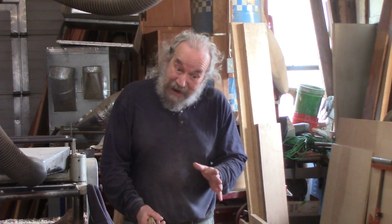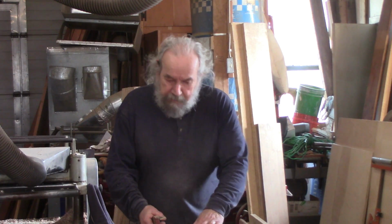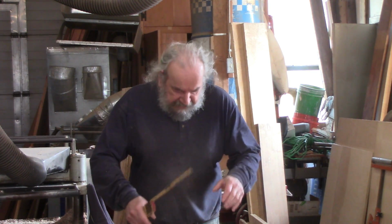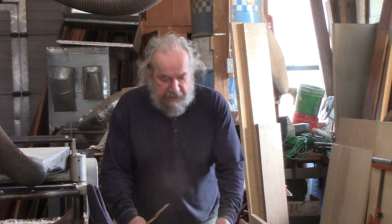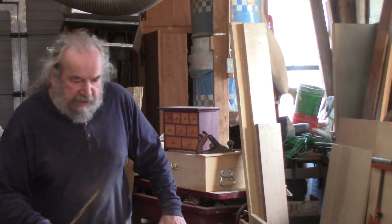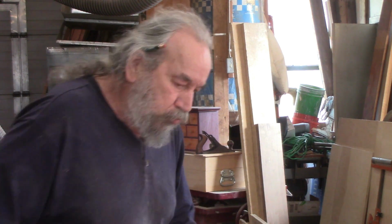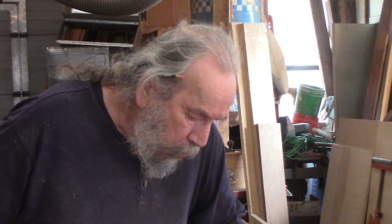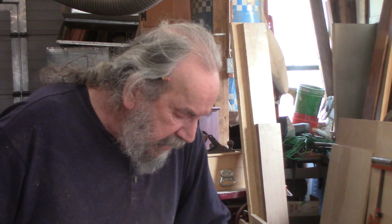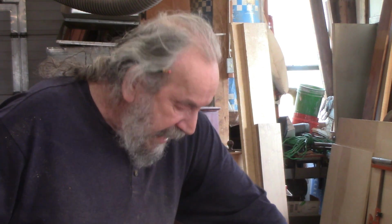but it's maple. So that is great for strength, and the boxes are tiny, and it's spalted, but it's right. Believe me, it's still good. It's got some color. The fungus has done some work to the wood, but it hasn't degraded the material enough that a 1/4 inch thick piece won't make a 5 1/2 inch long drawer. You can see some white fungal material here. It'll be fine. You can't put a fingernail in it anywhere.